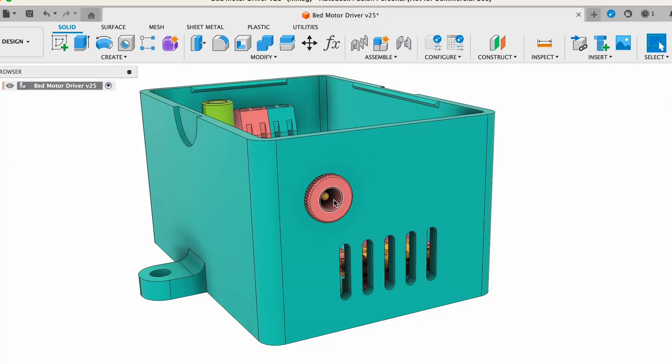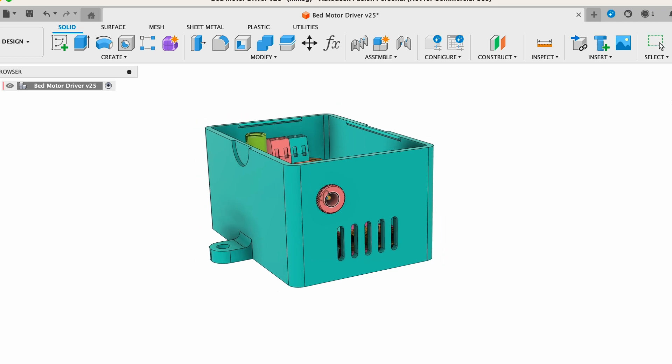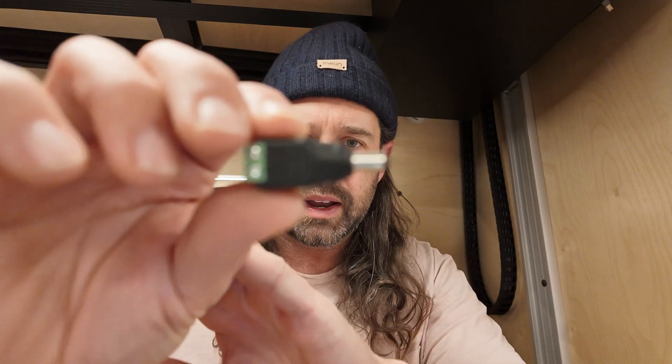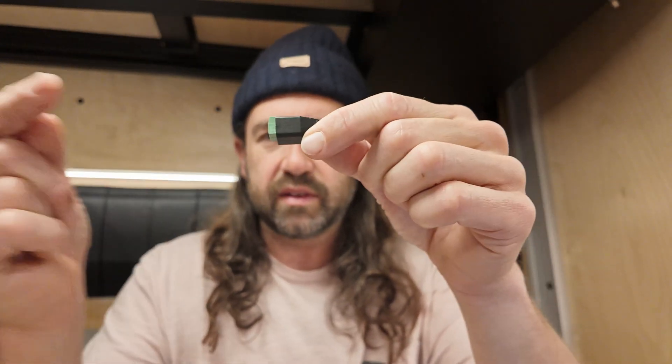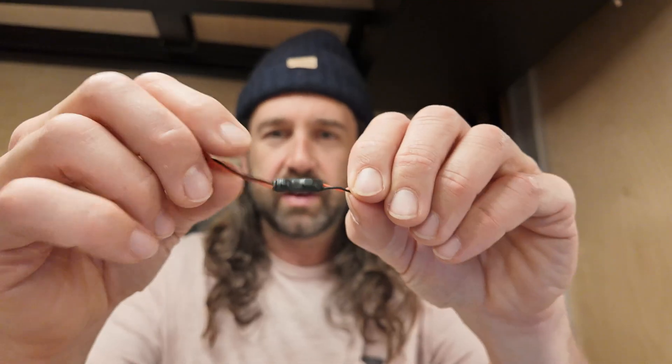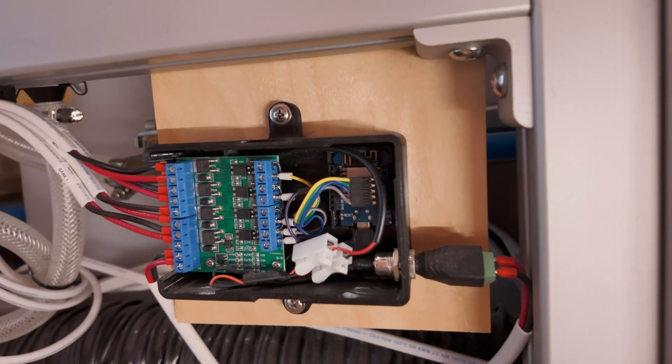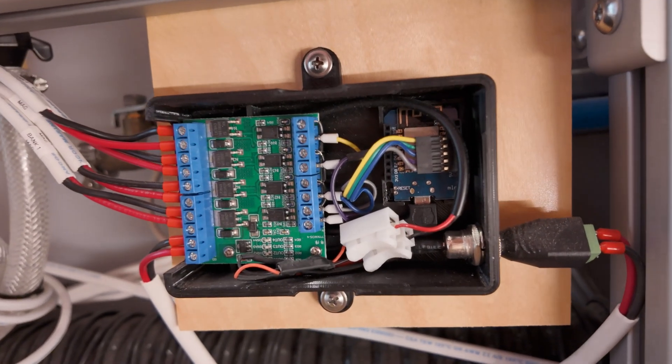The small regulators are really affordable, tiny, and fit inside a 3D printed case. I usually print a hole into my 3D printed cases to accept a female barrel connector, so I can use a male barrel connector with screw-down terminals to send 12 volts in, run it through the step-down converter from 12 volts to 5 volts, connect that to a cut USB cable, and plug it straight into the microprocessor. That's how I usually get 12 volts into my microprocessors.